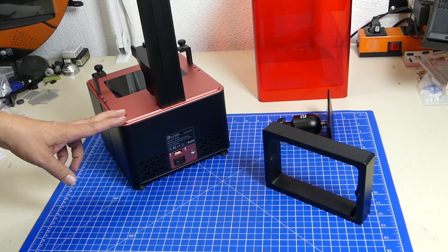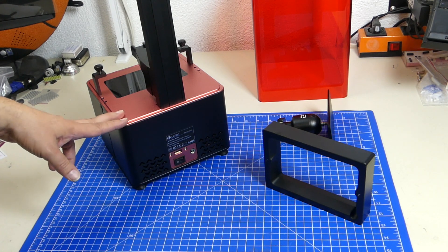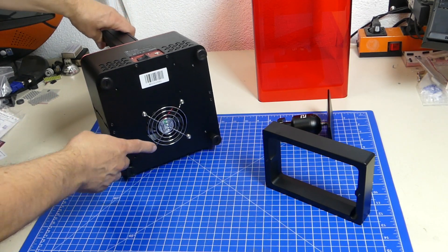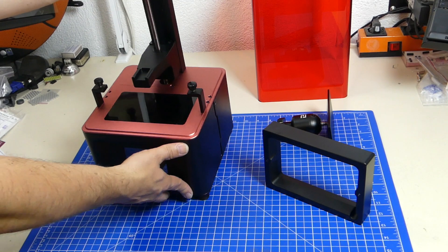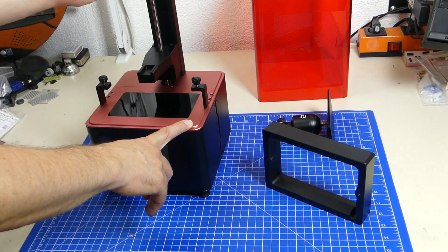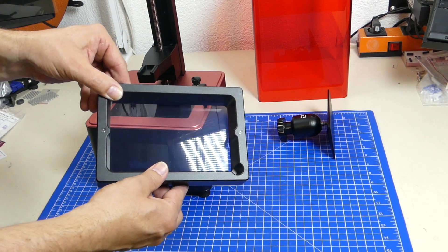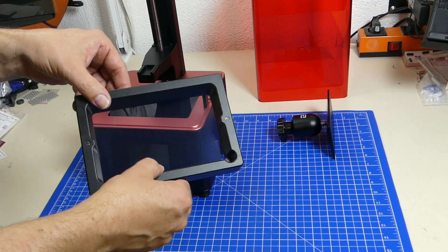Ultraviolet curing resins and ultraviolet curing epoxy has been around for quite a while — in fact dentists have been using it for longer than 30 years now. There is a pretty huge UV light in the bottom of the 3D printer shining upwards. On top there is an LCD display like those in mobile phones, and the UV light is led through the display onto a tray. In the middle of the tray there's a very thin foil acting as a membrane, and the UV curing resin sticks to that membrane.